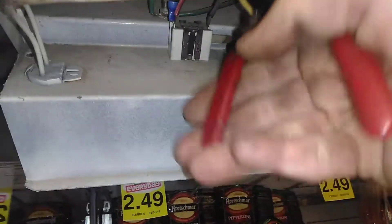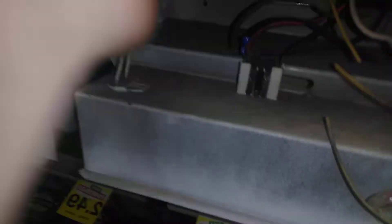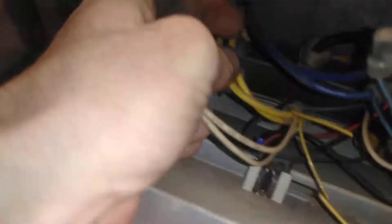We are going to cut — these are from the ballast. So for now we'll just cut them and we'll call them the negatives because they're hooked to both the bottom and top light bulbs. You'll notice the white goes here, yellow is going to run up and go through the bottom. Same way with these here. Blue ones — cut them. And then we got our red here, which is two lines. Got them cut. Got your blues cut. Got your yellows cut.